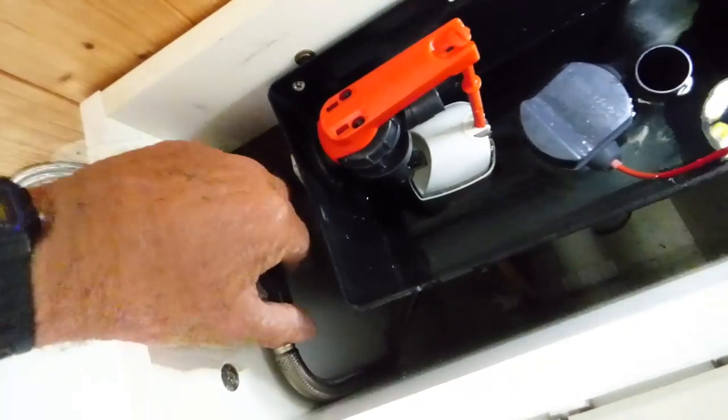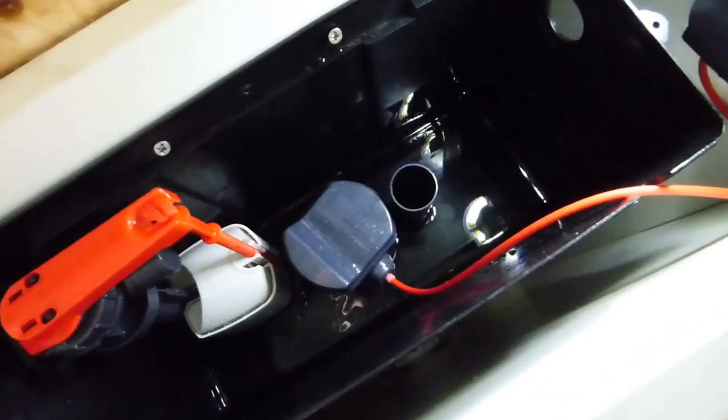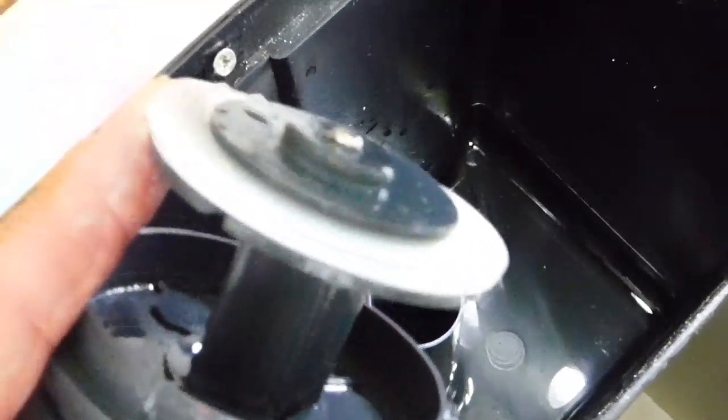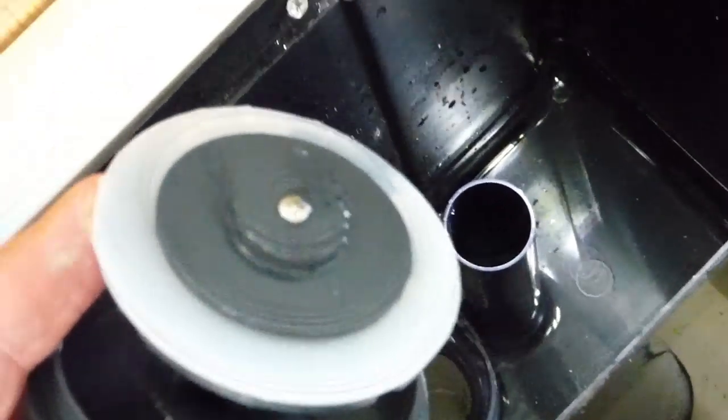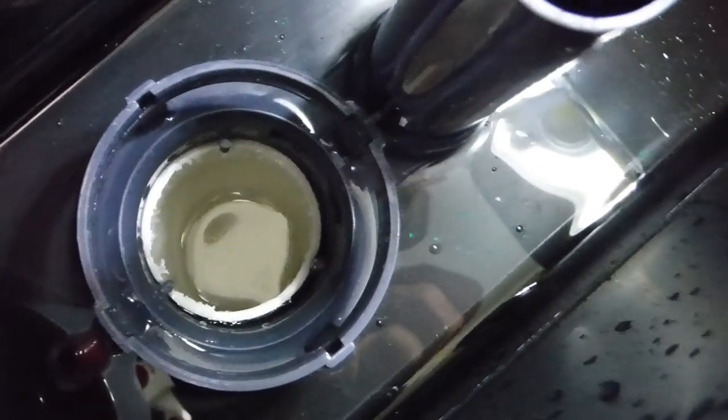I'm going to see if I can get my finger in and get it out so you can see, because it's easy to see once it's out of the system. Turn the water off first of course, which I can now via my little valve. These are usually a left-hand twist - I've got a little lever down there. A left-hand twist and it should pop out like so. Once it's out you can see what it's all about. And mainly it has to do with this washer here - that is what can go wrong, it can split. I'll pop it out there so you can see it properly. You can get replacements anywhere for that washer. Don't be tempted to turn it around, just put a new one on. Also the bottom of the system there - there's the housing and it sits into that. Do make sure there's no swarf or anything over that housing.